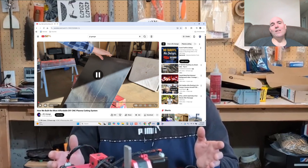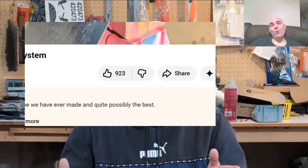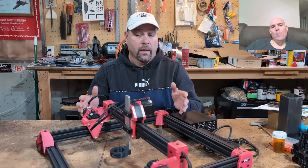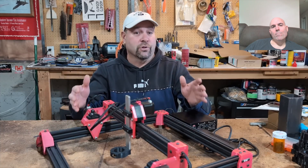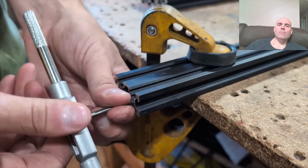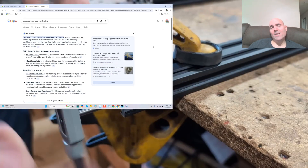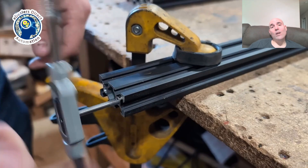This video he's talking about is on YouTube — I had to re-edit it in full because he decided to add a lot of audio to it. You can see how many views and likes this video has pulled. Mr. JD claims you can do this build starting at just over $250 for the CNC machine, based off 20 by 40 aluminum extrusion that comes pre-cut to length. My question has never changed: if you're using an anodized aluminum extrusion for the chassis, you cannot ground anything that's anodized — because anodization is a coating, an insulator, which means it does not conduct electricity, sir.